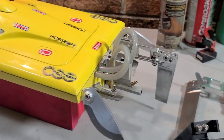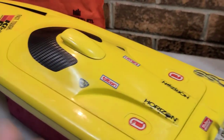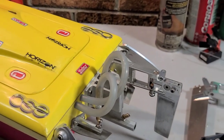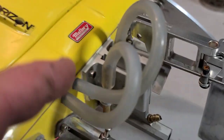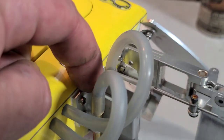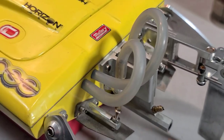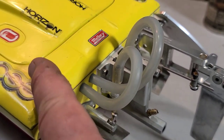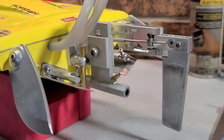There are other areas where water can seep into the boat and you won't even know it — you'll keep finding water and can't trace it down. One very common area is through your hardware. Marine adhesive sealant like Loctite on your strut, your rudder, your turn fin — any screws or bolts going through the hull of the boat need to be sealed up with some sort of adhesive sealant. That's a common problem, especially with ready-to-runs where they often don't seal up the hardware.